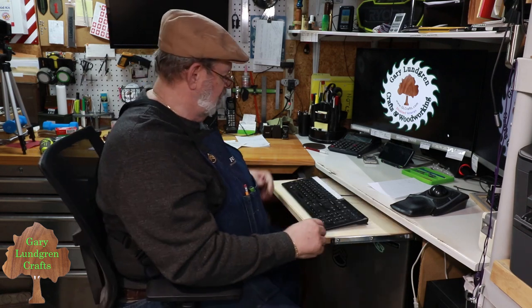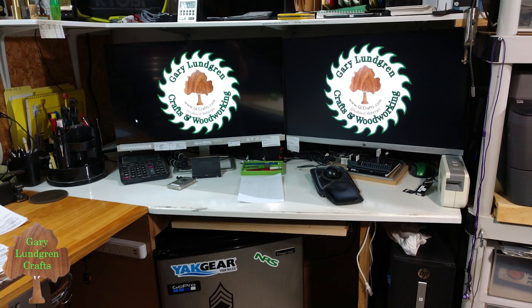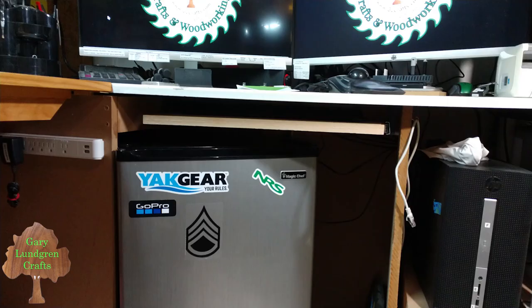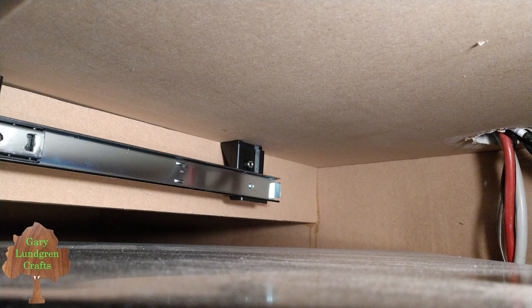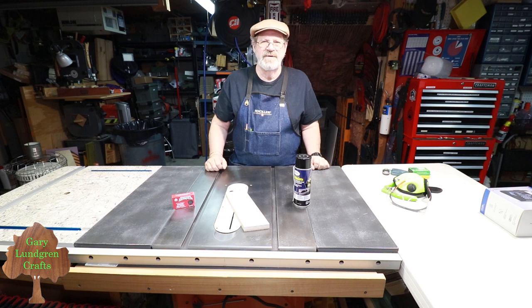I may finish this board off and give it some protective coating like a varnish. Here are a few shots to show how this looks after installation with the keyboard tray open and closed, and here is an image of how the keyboard tray fits underneath the desktop. These drawer slides are unique in that they are also height adjustable — they can be mounted lower to give more clearance for a higher-profile or thicker keyboard. Mine is mounted to give minimal clearance because I have a low-profile keyboard.